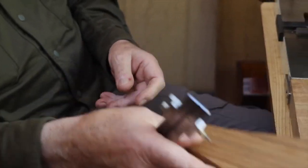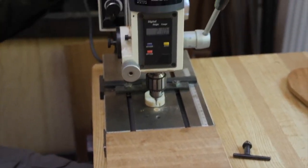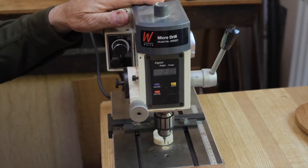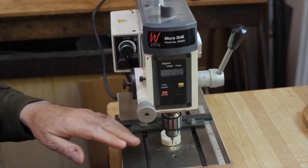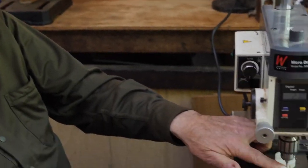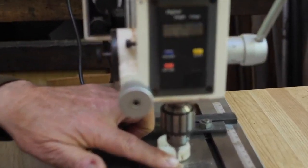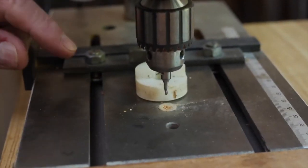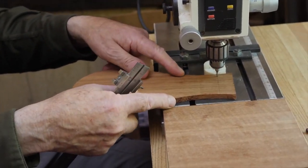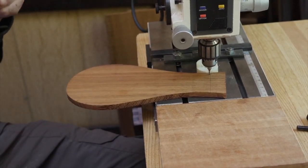So what's this machine that you're going to use? It's quite an accurate drill, sometimes known as a mill drill, because they use a very similar one as a mill, so it can stand quite a bit of side load. And I've got this 2mm round nose milling cutter mounted into this drill. So round-ended rather than flat-ended? Round-nosed milling, yes. Usually that doesn't really matter that much, but I like the idea of having it round-nosed.